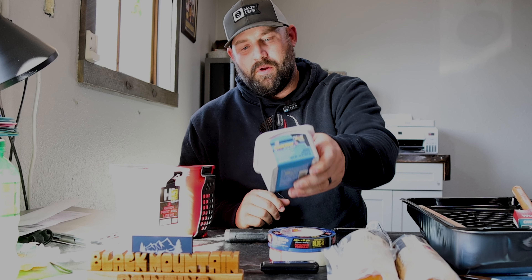It's a really good product and there are a lot of them on the market that do the same thing. Just pay close attention to dry time, because some putties have a 24-hour dry time. The last thing you want to do is putty all the walls, get motivated, and then have to wait until tomorrow to paint.